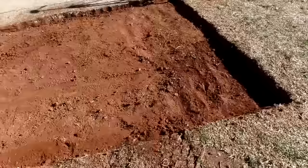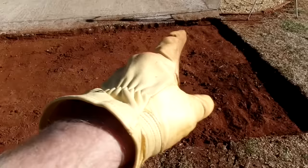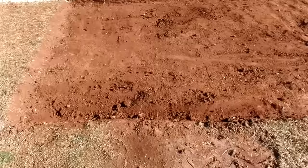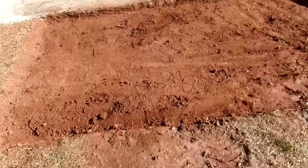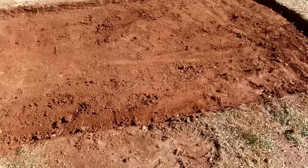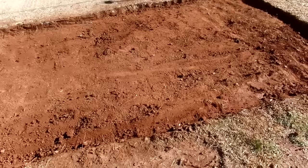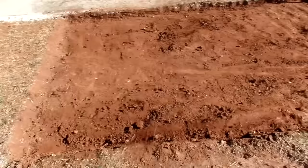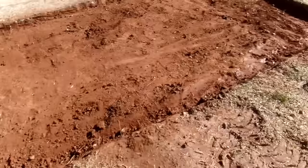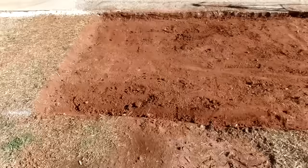What I'm going to do next is use a rototiller to loosen up this really hard stuff, especially right in here where it's a little bit high, so I can get that off. What I've read about this is it doesn't have to be perfectly level — it can have a little irregularity — but what you don't want is it too high where the ground grid ends up above the ground level, because that will destroy it. You want it down low. It just needs to be pretty flat so the ground makes good contact and you don't have a hump with gravel getting under the grid.